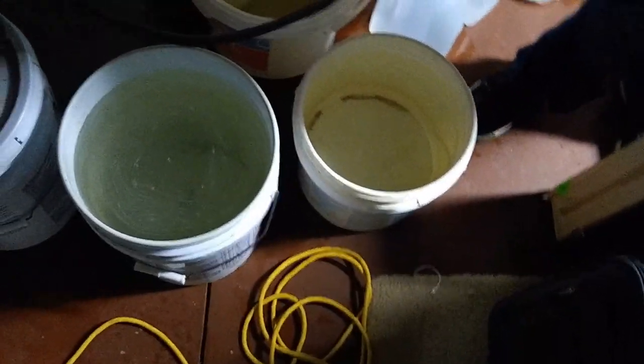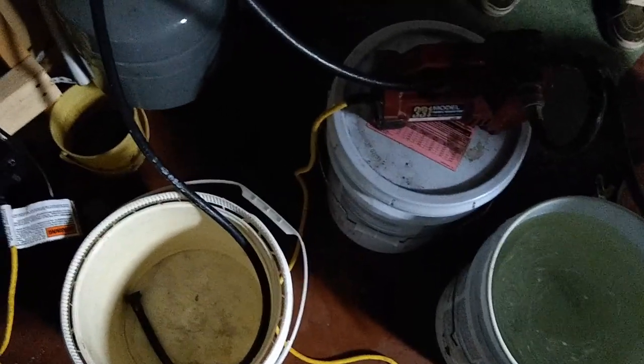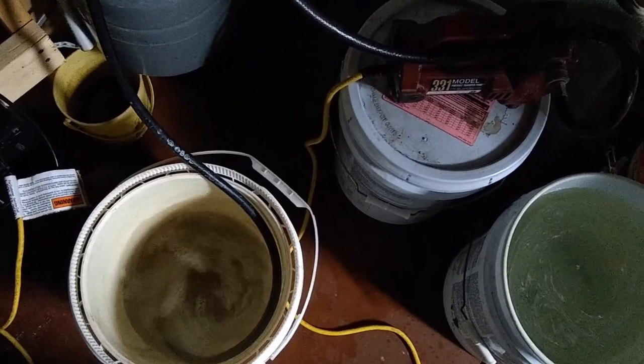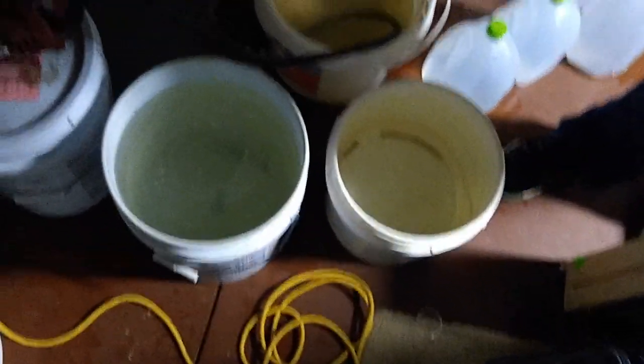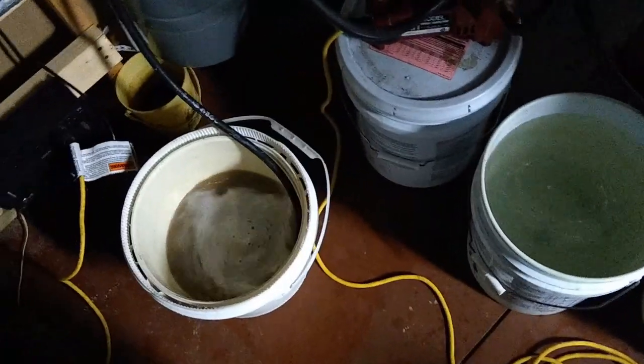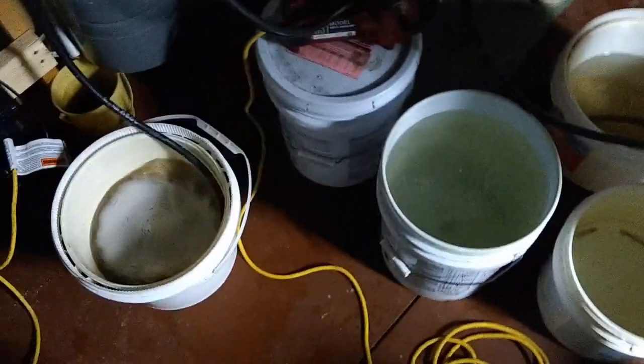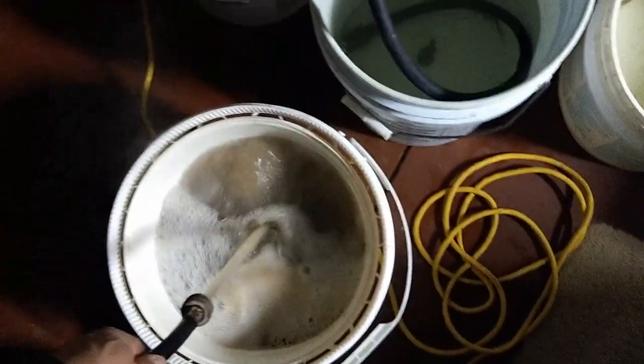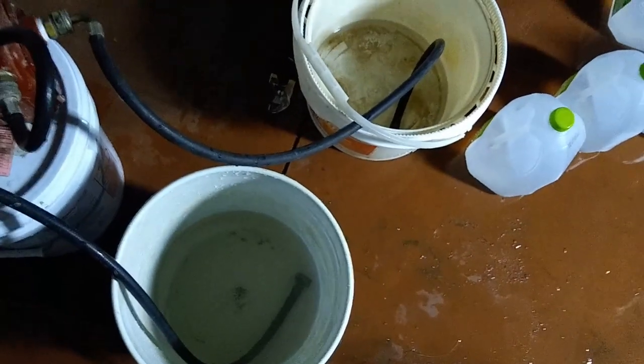At this point we're going to get rid of the vinegar sitting inside the system and purge it out with fresh water. We'll release the valve and refill with fresh water, running this until the buckets are emptied — that's how we know the vinegar has been purged from the system. We're getting all the crud out, everything that's left in there. Once the discharge water is finally clear, we'll get ready to start filling with working fluid.